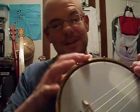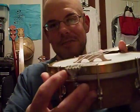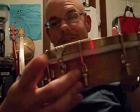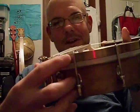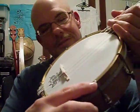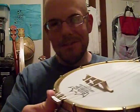And I took this brass stock, bent it into a hoop, made a dovetail on the end. It's covered up by the tailpiece, you can't see it, but I cut a dovetail on the end, joined that together, flowed some solder into that. It's a good strong joint. Cut these little notches for the hooks in there, notch for the neck in there, done all that with the file. Everything I do with hand tools.